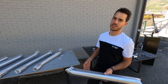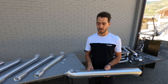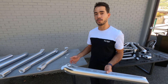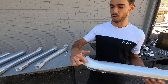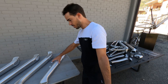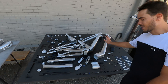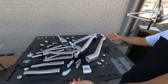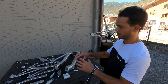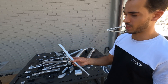As you can see, it's quite a lot of operations and it's not even over yet — we still have to weld it, perform heat treatment on the frame to get rid of all the stress induced by the weld, and then do final machining. For example, the thread treatment we do after welding to make sure everything is perfectly aligned. And then I'll explain this part — as you can see there are many more parts and we have to go through all the processes for each of them.